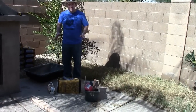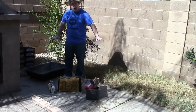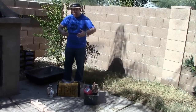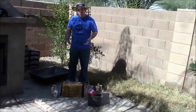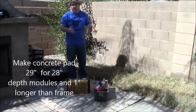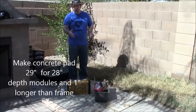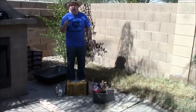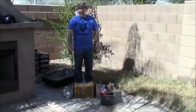A lot of people want to use pavers. It is better to make a level concrete pad first for your outdoor kitchen island and then bring the pavers up around it. When calculating the pad size for that situation, take the depth of your frame — for instance 28 inches — add the cement board, an extra half inch on both sides front and back and on the ends, and factor in whether you are going to have stucco or stone veneer.